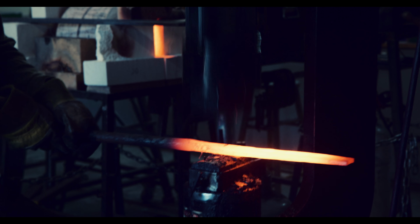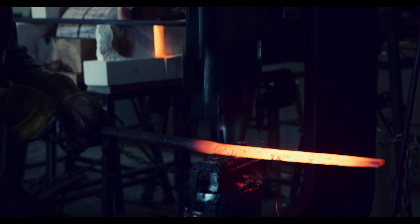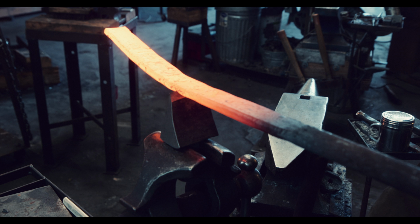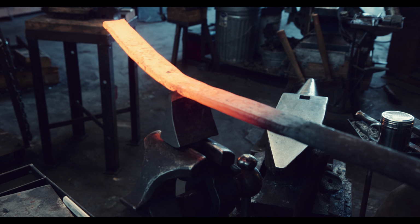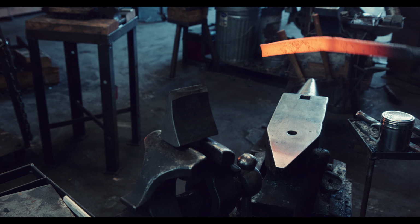I often prefer to use wrought iron for this, as it has interesting patterns due to the inclusion of impurities, and on top of that is very soft. Unfortunately, the wrought iron I use comes from the 1887 Globe elevators and is very high in phosphorus. It provides very nice contrast, but also means that it comes apart easily and is difficult to work with.